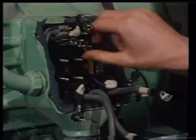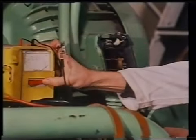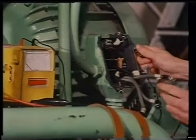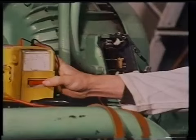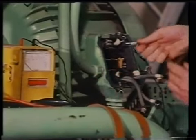Each time you test a part of the circuit to earth, check the insulation resistance tester first, with the probes together. Find 2 good earth points. And then test the circuit.